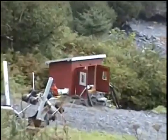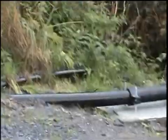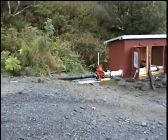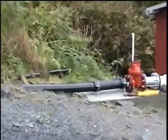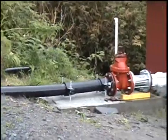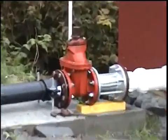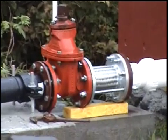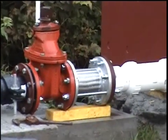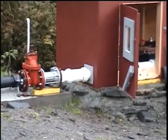We've got 1,200 feet of 4-inch pipe — it's black HDPE pipe coming down the hill. There's an isolation valve there, a stainless steel flex connection that allows for shrinkage as well as flex from side to side, and then white PVC.